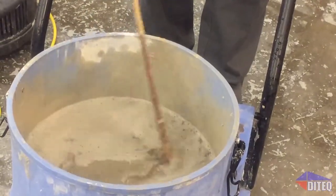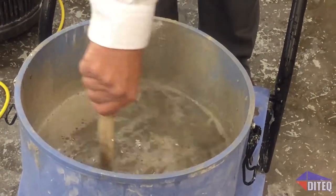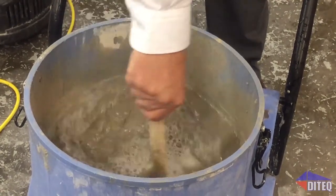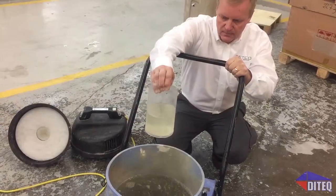When the vacuum is full, remove the top and stir to finalize the reaction. Use a paint mixer on a cordless drill or a paint stirring stick. Mixing thoroughly is key to this step. You will see the flock formed in the water and the clarity increase.